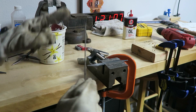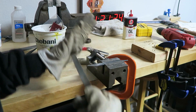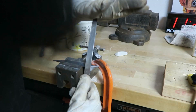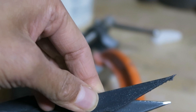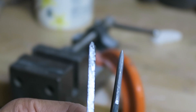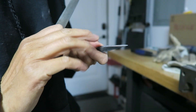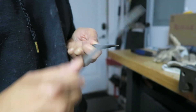To get rid of those deep scratches, I'm going to use my single-cut mill bastard file and do 10 strokes. Nine, ten. Same thing here — one through ten, repeated on each side. Nice and smooth. Flip it over so we can finish off the other side. Here is how it looks before filing, and here is how it looks after filing. The key to filing is to get rid of the burrs but also to get that tip nice and pointy so it can stick into the target better. Here's a close-up of the filing plus a diagram showing the angle of the file and the number of strokes. The last thing I like to do is wipe away any metal shavings, then feel with my finger for any rough spots and freehand remove those with the mill bastard until I can't feel them anymore.